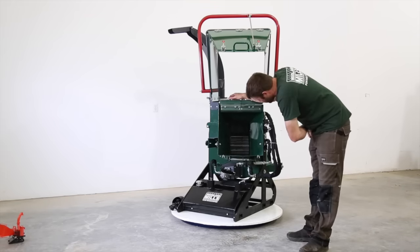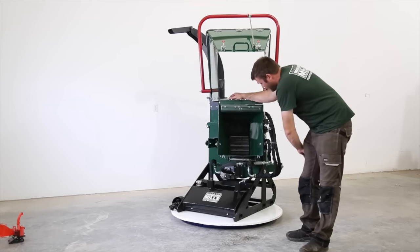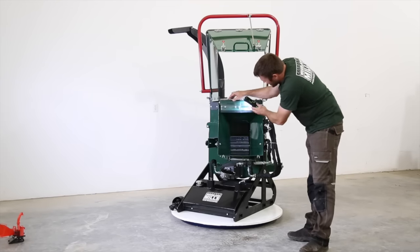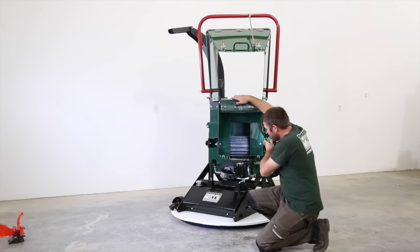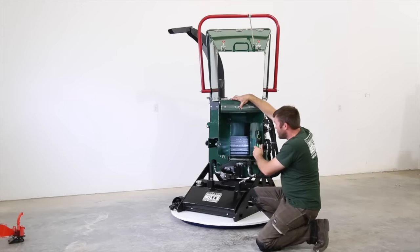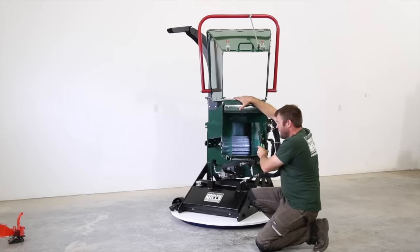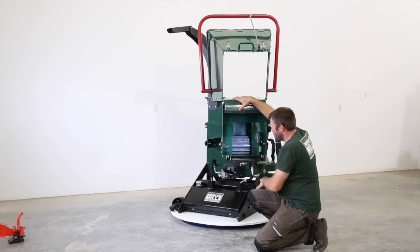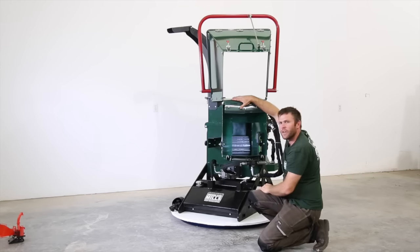Inside of here, we've got our infeed roller itself. Now this roller, not sure how well you can see it. I'll use a flashlight here. This is an 8 1/4 inch diameter infeed roller with hardened steel chisel knives on it. This infeed roller is large enough to hop up over any material you're gonna try and feed into this. These chisels dig in as you present the material to it, and it climbs up over the material.